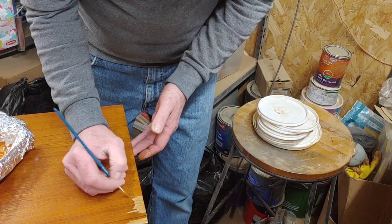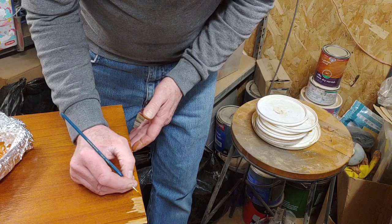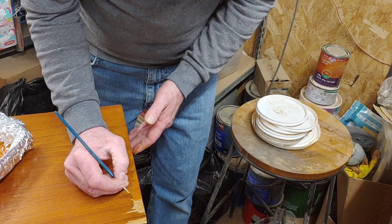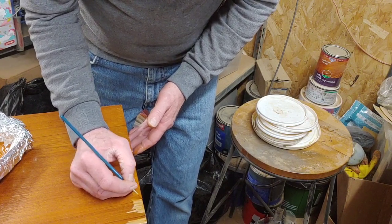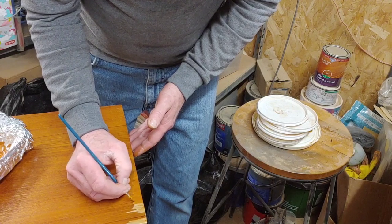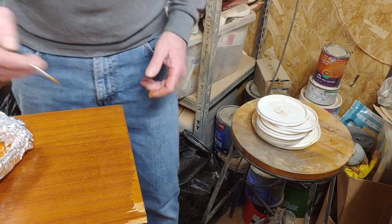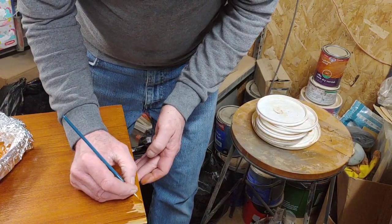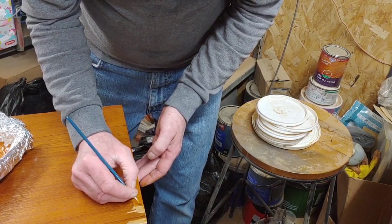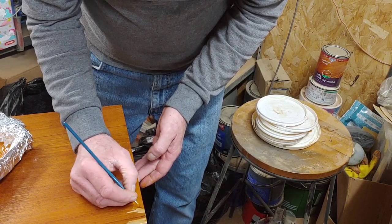So what we do is we have to fade. Once we've touched on the false grain, we need to fade. We need to tint the wood down over the top with a milky consistency. And so what it does is it fades the grain back, and then we lift the grain back up again with a tinted polish. So we use a very tiny bit of red mahogany in there just to give it a slight yellowy red colour over the top to bring it back, which I'll show you in a minute once we get to that stage.